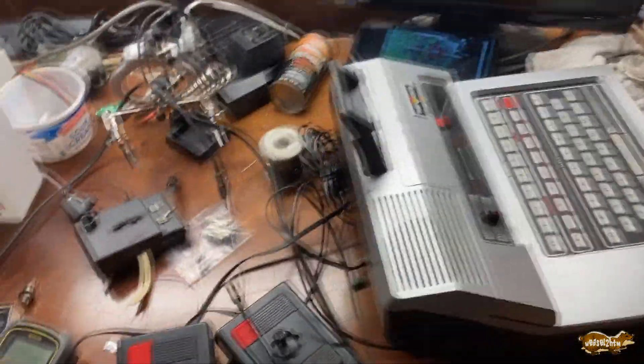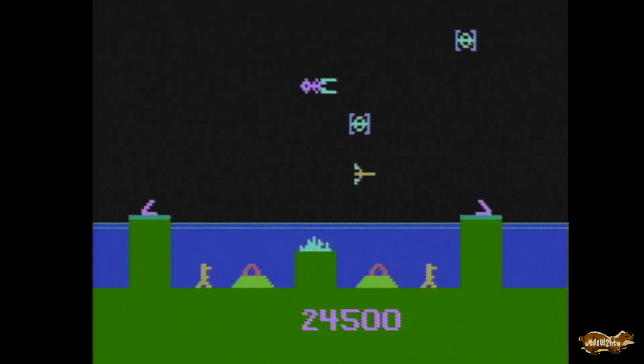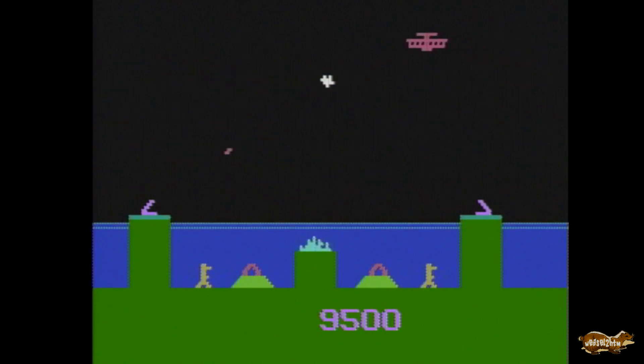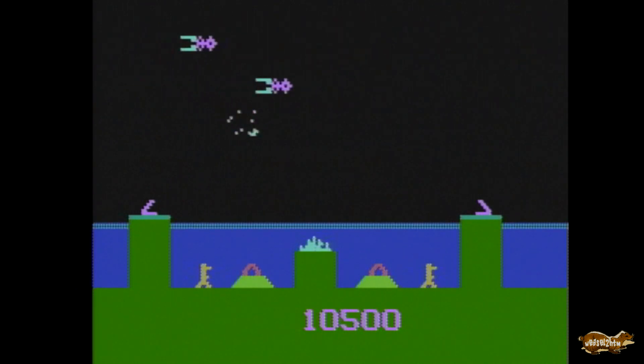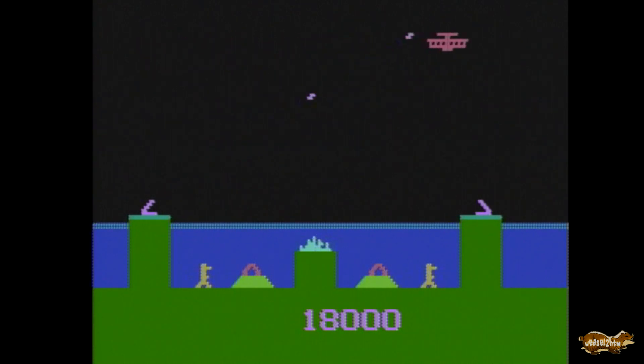Because this game console was not meant to be up next to the TV — it was meant to be sitting on the coffee table with the keyboard and stuff — my thought is, if it's being played and somebody walks along and trips, that's the point where it can get separated and hopefully not pull the console off the table or the VCR off the shelf. A couple things I noticed in editing: while the video is a bit cleaner, I was impressed how good it was with just the RF. The sound seems a bit more clear now, but the sound coming out is really hot. I may have to go in and add a resistor at some point, but given it's just sound effects, even if it's distorting a bit, I don't think it'll be that noticeable. The voice — when the alien guy was talking — comes directly out of the speaker on the voice module. It does not go through the output, so you won't notice a change on that.